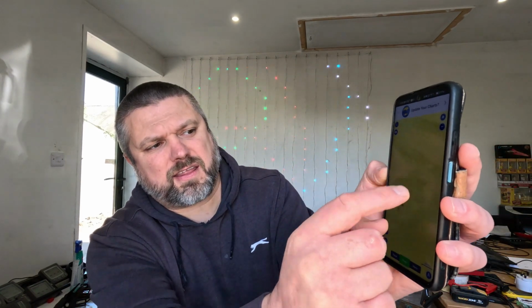And just to show the actual, if I zoom out, you can kind of see there, if I hover over it, I can see Freebird, and then if I click the boat name, it shows up at the bottom. So that's how you get NMEA data onto your Navionics. Now Navionics, I've noticed, only supports GPS and AIS. I've tried wind, depth and everything else through various contraptions and none of them work. But for this experiment I just wanted to show AIS.